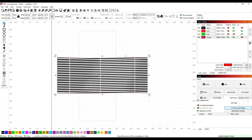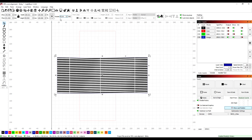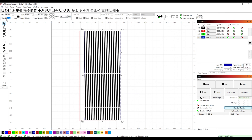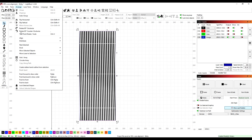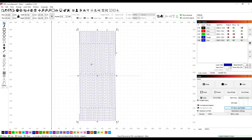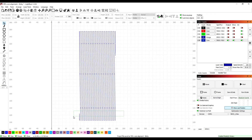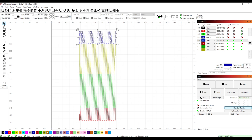Once imported and aligned to the cutting area, a trace image function is run to set a path around the dark areas to be cut away. The path lines are ungrouped and then regrouped into horizontal sections. This allows the laser to cut across the piece in sections, rather than following a single line around the entire cylinder before proceeding to cutting its neighbour. Now perhaps there's a better way to do this and retain the accuracy of the cut, so please let me know.